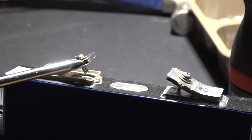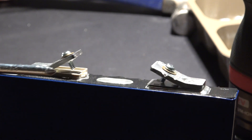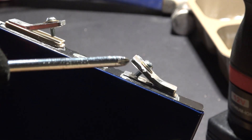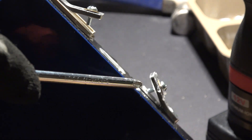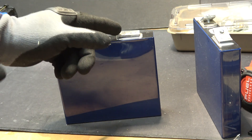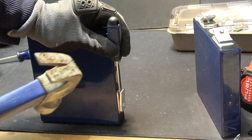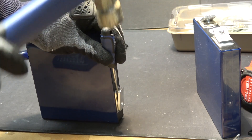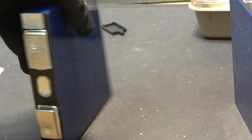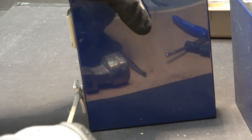On the negative terminal you can see the screw has a gap of about three millimeters between the end of the screw and the case below it. On the positive side it doesn't matter because the case is also the positive terminal. Now that I know what to do, let me show you how easy it is on the next cell. For the positive terminal it's very easy — you don't have to be afraid of shorting it out. Just put the screwdriver in there, bang it down, and pry it up. Now that it's up a little bit, just use a bigger flathead screwdriver and pry it up a little more.